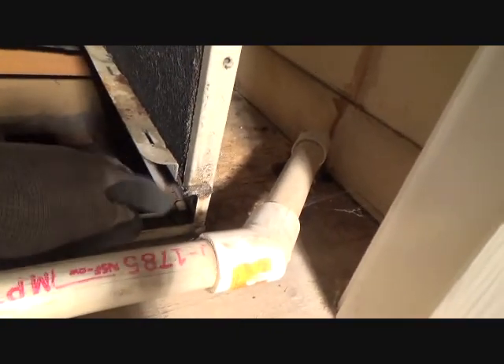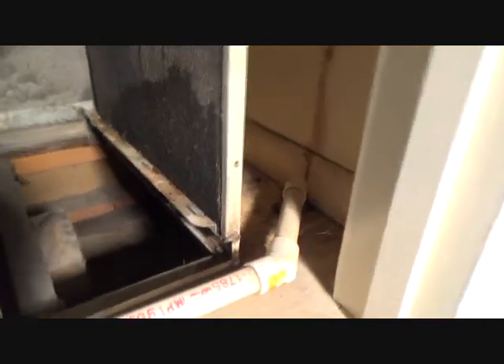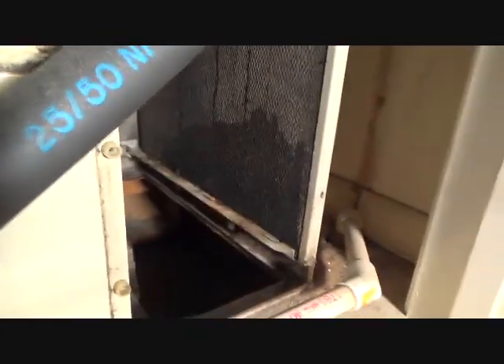Once we put the panel back on, it's going to start dripping again. I believe it's coming from this top edge, dripping down through the insulation here, down the back side of the insulation, getting this wet, hitting the bottom rail, and then drip, drip, drip right there. It's not coming from the condensate, which is over on this side — you can see where this comes down at an angle, and the water collects here where the condensate comes.